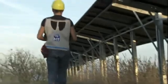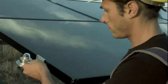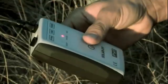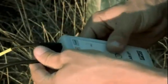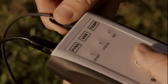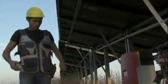The temperature of the photovoltaic modules is detected by means of a probe which is positioned on the lower surface of the modules. Irradiation is measured by a precision transducer. Environmental temperature is detected directly by the remote unit. When the ready LED on the remote unit is on, at least one valid irradiation value has been acquired while measuring.